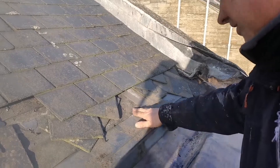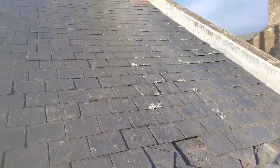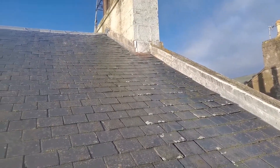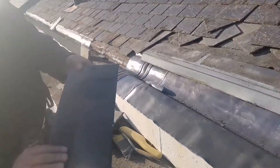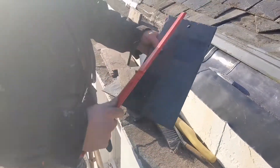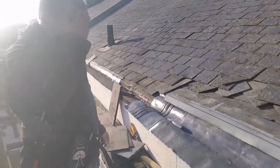A lot of these slates are pretty crap and I'm really not keen on this head nailing. I know people say it's great because you can spin them around to change them, but the wind spins them all around — look at them all. Because they move, they wear away the top of the slate and the nail just ends up popping through. That also decreases your headlap — the headlap was there, but because they're centred you've lost a good 30 mil off your headlap, so they've only got 30 mil left.